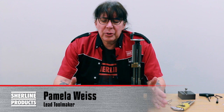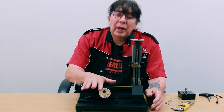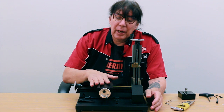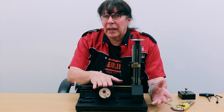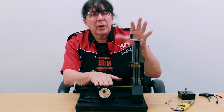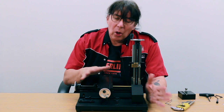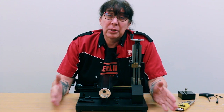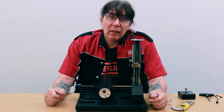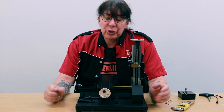In this segment we're going to address a few issues that customers have been having questions about — namely removing the resettable hand wheel, both the standard X and Y and the X on the lathe and the Z on the mill. The Z is the only one that's a little bit different because it has an extra screw. We'll also get into a little bit of adjustment when setting your backlash, and you want to make sure the hand wheel backlash is set first.